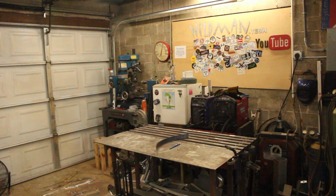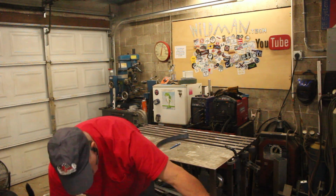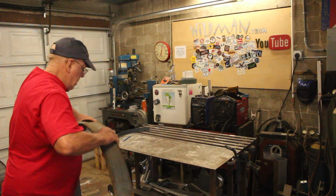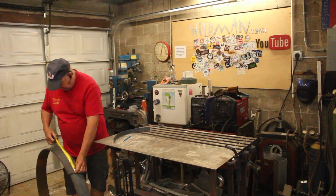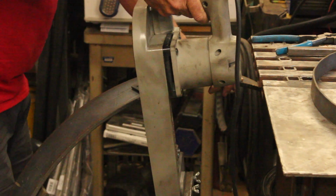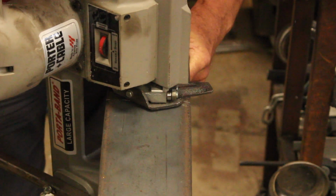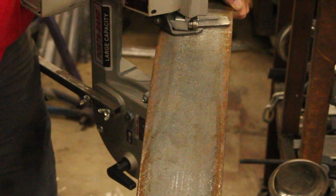The idea was that we would have two 3/8 by 4-inch steel legs that were radiused, and they would be connected by a steel bicycle silhouette that I'll cut out. Now, rather than having each leg cut and rolled separately, I decided to just have one long piece rolled that was plenty long enough to do all 4 legs, and then I would cut them out.